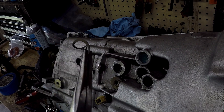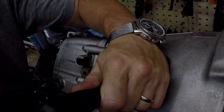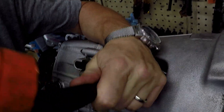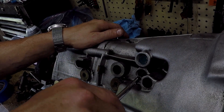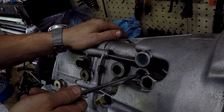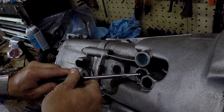Once you get the snap ring out, you have to be able to get that little green cap out. Generally you just punch a hole in the top of it and screw a screw into it — something you can get a hold of and pull the cap out. This one I got a little aggressive on the hole, a little too large for a screw, so I was ultimately able to just pry it out with the punch.